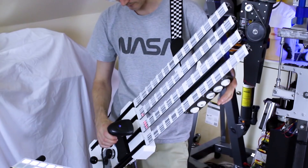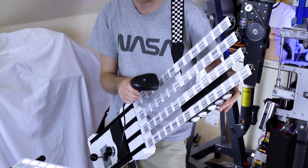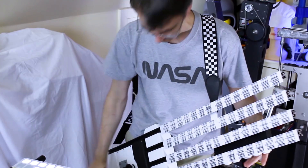We can build any interface to anything really — a MIDI instrument like a barcode scanning guitar, or anything connected to an Arduino with a MIDI or OSC output. There are OSC libraries for Arduino; all you need is an Ethernet shield to make any connected device interface to QLC Plus and control some aspects of the show — perhaps floor pressure pads or big knobs with encoders that kids can use to alter the RGB values of all the lighting. For now I need to do more — put hands on the robots with light-up hand backs — but here's a scripted robot show.